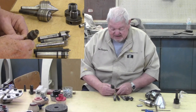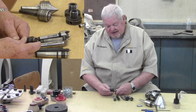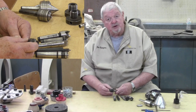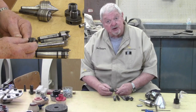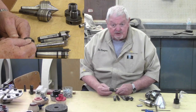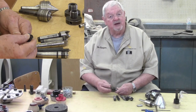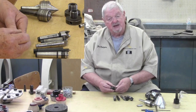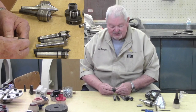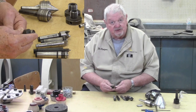The last one I'll show you is called a safe drive. I don't see this used very much, but it's a great drive because as you push in, this cup bites into the wood. More pressure means more holding force; less pressure means less holding force. That means if you're teaching the use of a skew chisel and you get a catch, if my pressure is set right, the wood will just stop turning — it will slip on this, allowing you to save your project, save your nerves, and continue to practice. I have maybe a dozen of these at home for when I teach skew chisel classes.